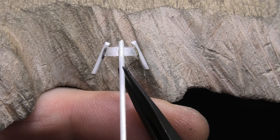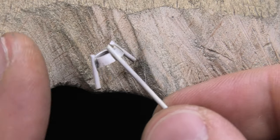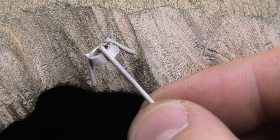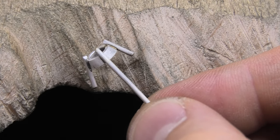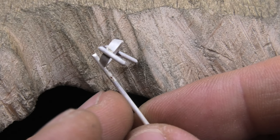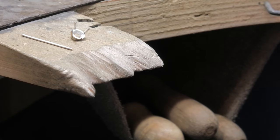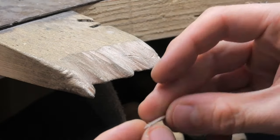Making life easy for myself - always trying to be accurate. If you've phrased it wrong and then you've had to hold the claw out at a wrong angle and then solder it, it's more likely to fall off. If you're kind of filling gaps with solder you can get very messy very quickly - trying to heat something up next to it and it'll just fall off. Just want to show you: if you're struggling to get your claws in the correct position, watch this.